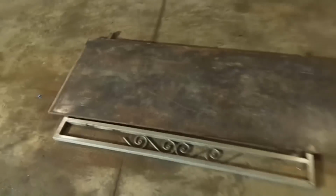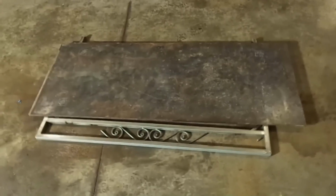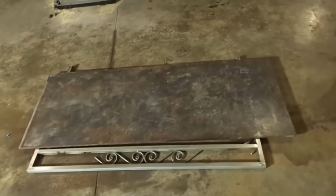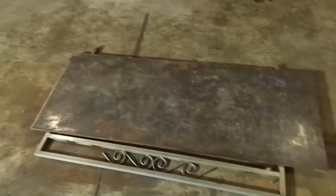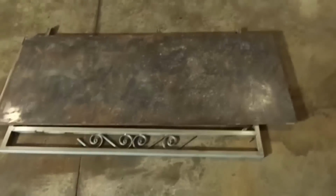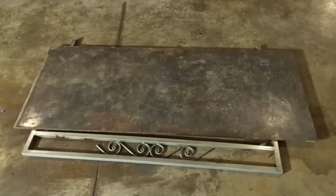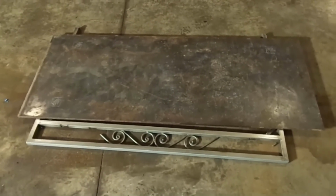Also, I'm not sure what the mounting holes are going to be because I don't have the vise yet. So that's going to be an issue if I go ahead and put the legs somewhere and I can't mount the vise where I'd like it. So I kept them off that far, so that way it gives me more options when mounting the vise. And when I put the stretchers in, going from each leg along the length of the table, it's going to give me room in the front to put a C-clamp on things, so that way I can clamp things down a little bit easier. I don't have to work around a stretcher, and yeah, so that's where we're at.